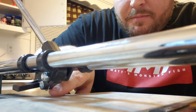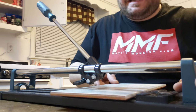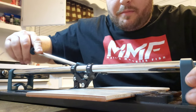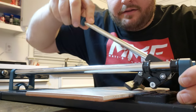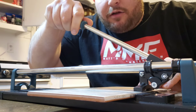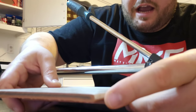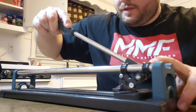See the scoring wheel here — that's going to make a mark in your tile. You want to line the tile up. I've already cut this piece in half, and we're going to cut it in half again. This is how I made all my detailed cuts. You find your line, line your wheel up with it, put it right on the tile, and it's going to score and make a mark on top of the tile, creating a weak point. Then this little stopper — you lift the handle up and the stopper drops down. Hold your tile here and lightly push down until it pops open. And look at that — perfect cut every single time. That's how I did all my detail cuts around the overflow box. This tool was only 22 bucks.